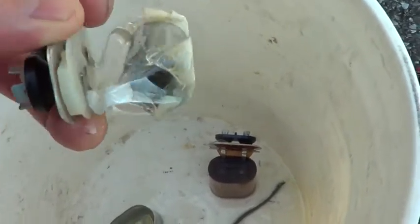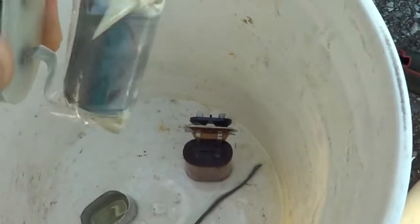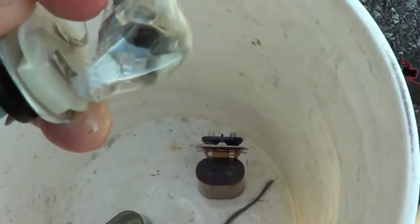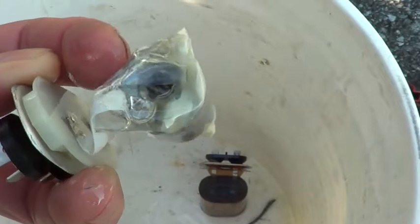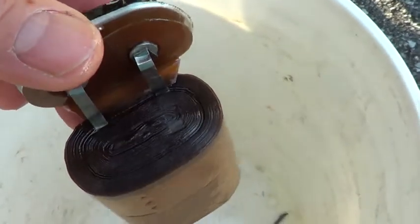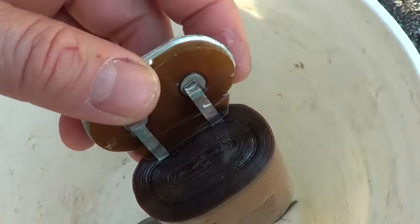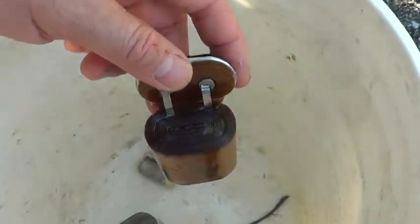The new capacitor is still rolled, but the ends are welded so it gets good contact. What they do is spray tin and actually weld the entire end of the plates. With the old construction, you only get the end of a plate — not in parallel — just the end, and it wraps up. So let's open these a little further and look at the insulator difference.